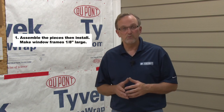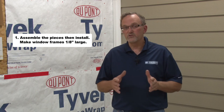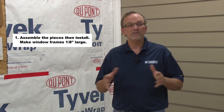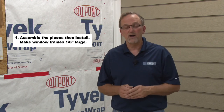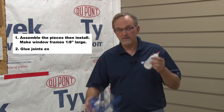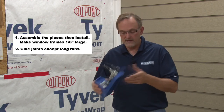Let's review the basics. First of all, when trimming around windows and doors, it's a good idea to assemble the pieces prior to applying them to the wall. And when you're measuring for those pieces, remember, measure 1/8 inch large on the width and the height to give some room for the movement of the product. Glue and screw the pieces together. Using a Kreg jig is a great way to do that quickly and easily.